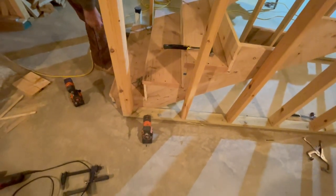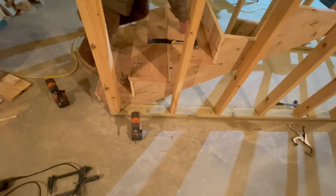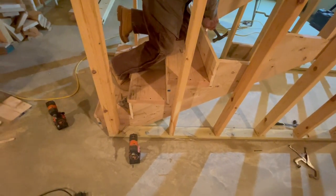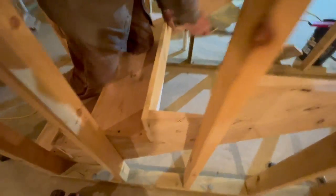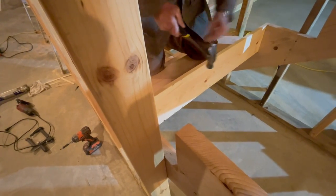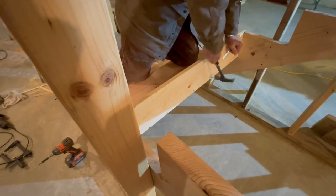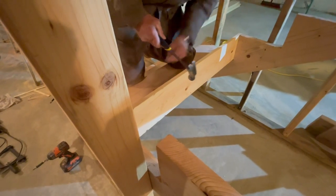I suppose you could blast one of these together with a nail gun. For a while there, boss, we had to build houses quicker so we started nail-gunning everything together. Something I realized - if you frame an interior wall with a nail gun it is the sloppiest thing - it just floats around until you get it secured. As opposed to a hand nail: I feel like one hand nail holds a board better than three nail gun nails.